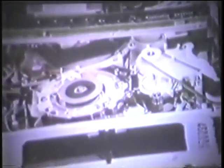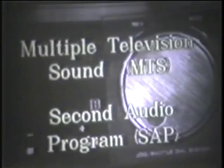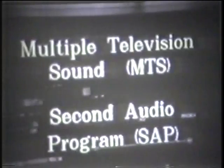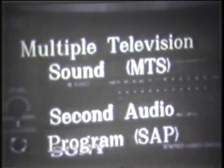Two other technical notes on the SuperBeta are, first, the use of 4 azimuth heads, producing greater picture quality by reducing crosstalk and allowing clear, sharp, and even still frames, and clear slow motion to 2 times the normal playback speed. The second is the 900's ability to record multiple television sound, or MTS, meaning television programs aired in stereo, as well as second audio programming, or SAP. Technically, SuperBeta is the world's best, but Sony doesn't stop there. Let's see the SLHF 900 combine the new technology with the new features.